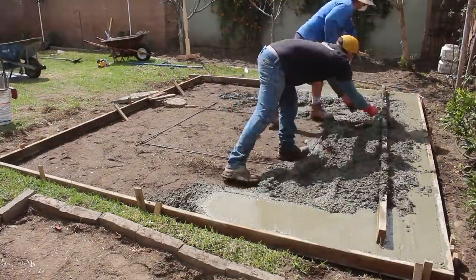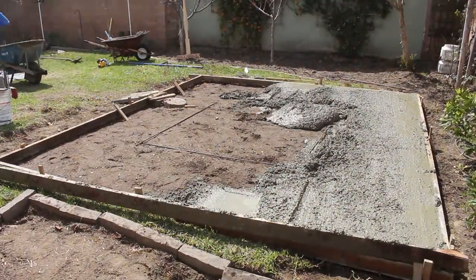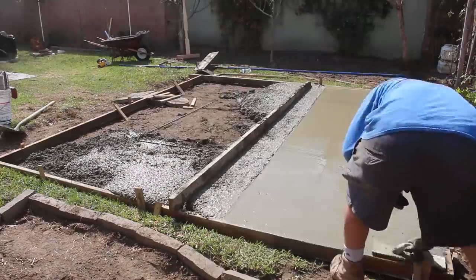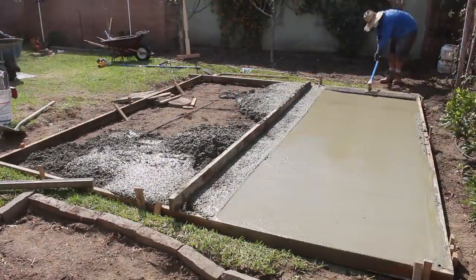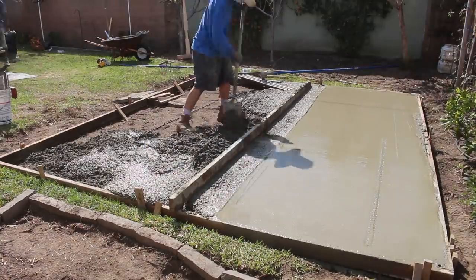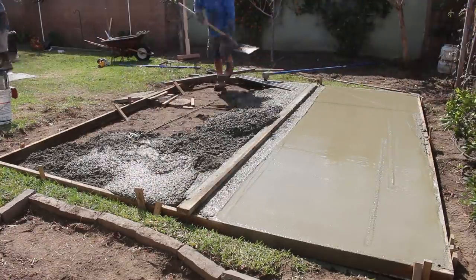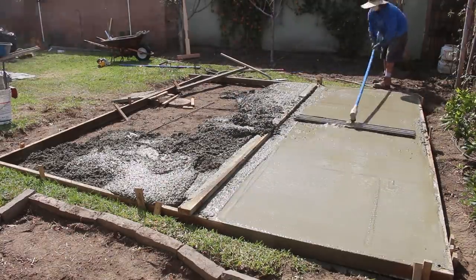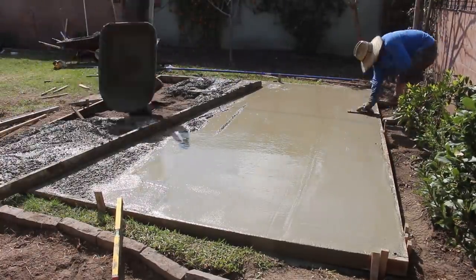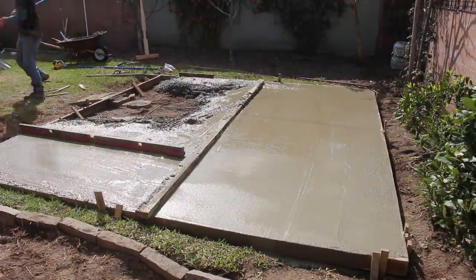And I know a lot of you watching this are probably watching from the East Coast or some northern states where you do see winter, but we pretty much never see winter in Southern California. It's beach weather year-round. The soil never expands, so we don't need to worry about putting 3/4-inch gravel or rock below our concrete. The only time our soil could expand a lot is maybe during a flood or a heavy rain, and usually with a clay soil, because clay really soaks up a lot of water. That's the only type of soil we would really have to worry about around here in Southern California. But otherwise, like I was saying, guys, it's beach weather. We don't really have to worry about that type of stuff.